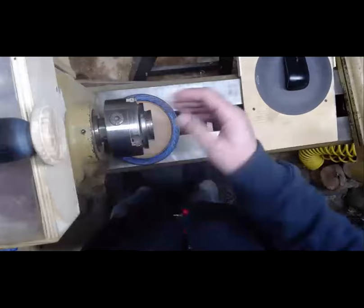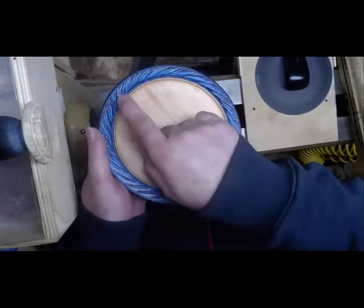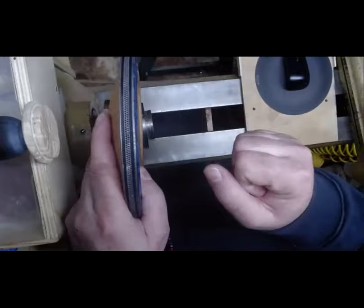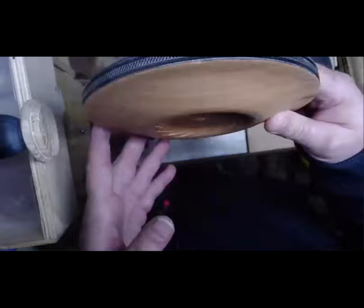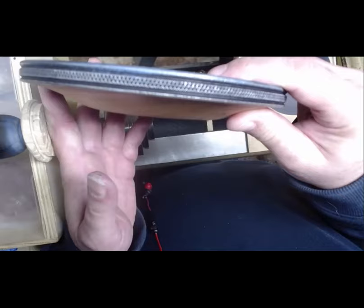And this piece here is a piece I textured, and this is cherry. The black is chestnut spirit stain, and the blue is Hampshire Sheen embellishing wax, electric blue. I've got some knurling here that I'm going to metallize with gilt cream, and then I did some stuff on the bottom of it with the texturing tool. Matt, go back to that knurling. Look how uniform it is. This is the Wagner knurling tool that did this. Craft Supplies and folks sell it.